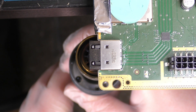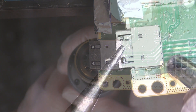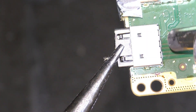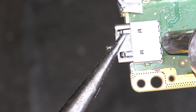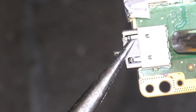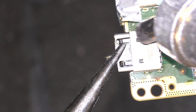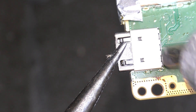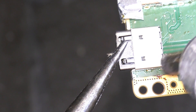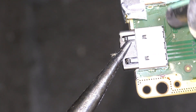You're looking for the solder in the locating holes to start going shiny on the top side of the board. And once you can see that happening, put the nozzle onto the air wand, crank the airflow up to 115 litres per minute, and work the heat topside, making sure to get plenty of heat into the locating legs and the HDMI pins themselves. Put a pair of tweezers or grips into the opening of the HDMI port and get a firm grip. You're not applying any lifting force on this port whatsoever. The tension in a firm grip on your tweezers or pliers will be enough to shift the port when it's ready to move.